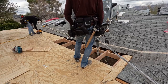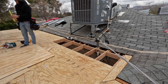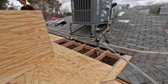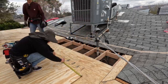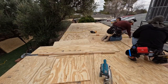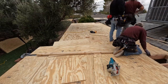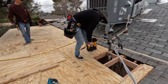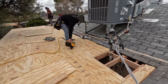Here we're doing that last row of sheets that ties into the existing house sheathing. This house sheathing from the 50s was like a one-by-eight tongue and groove board — very common with older houses. New houses you'll see OSB. These older houses maybe didn't have the best layout or quality control, but the materials were definitely stronger back then.